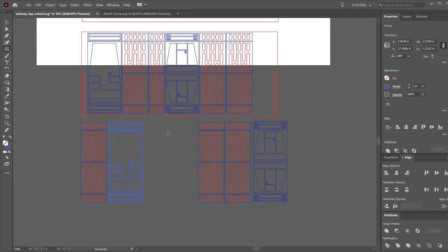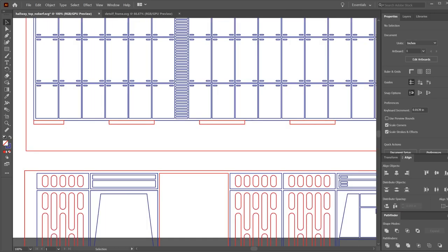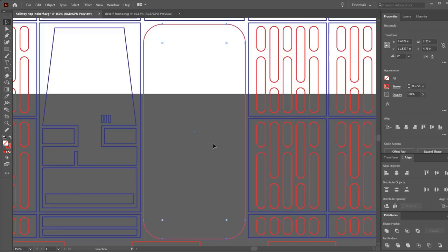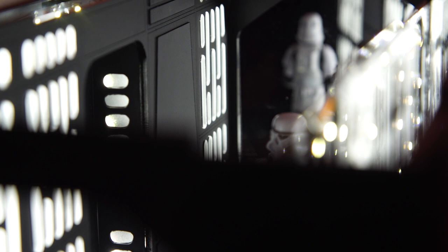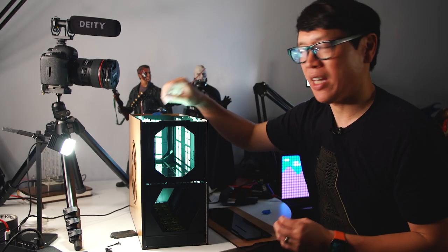I'm not a CAD designer — I didn't design this in 3D. I think about this in terms of flat forms and how they fold together. Baseboard first, then: if I'm going to have 1/8th inch thick acrylic, then all my slots are going to be 1/8th inch (0.125 inches) by some dimension. I decided not to mirror the walls — went a little bolder, added a door here, but reflected a lot of similar elements. These pill-shaped windows are also inlaid frosted acrylic. That extra accent of 0.02 black styrene was really the MVP of this whole project — cutting it on the vinyl cutter added just that extra bit of dimensionality.